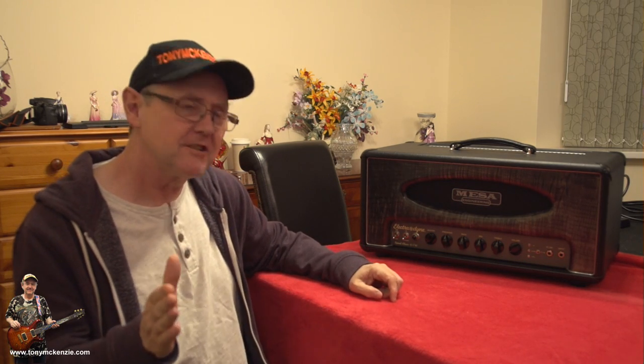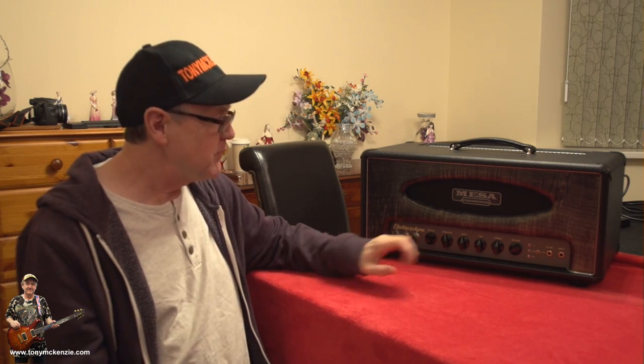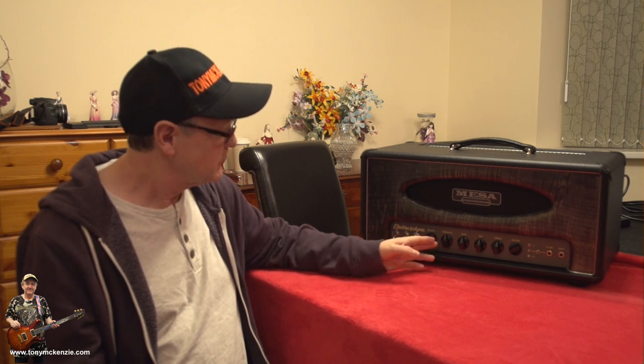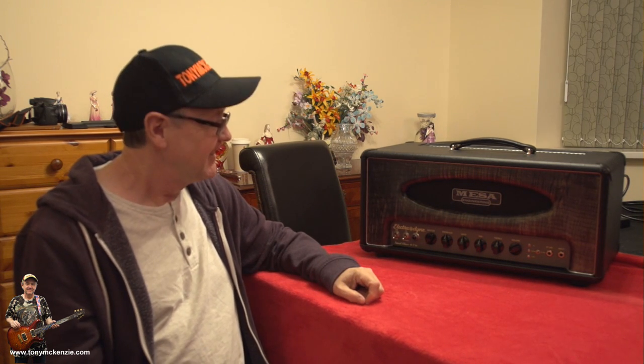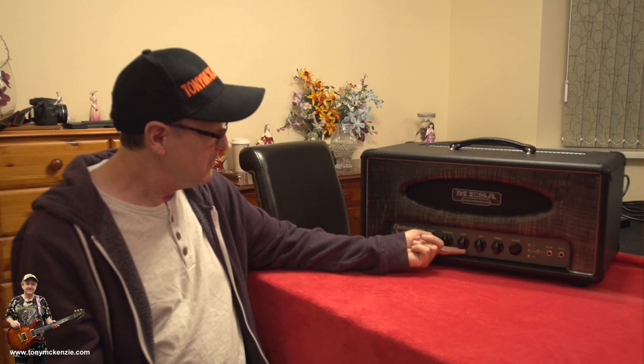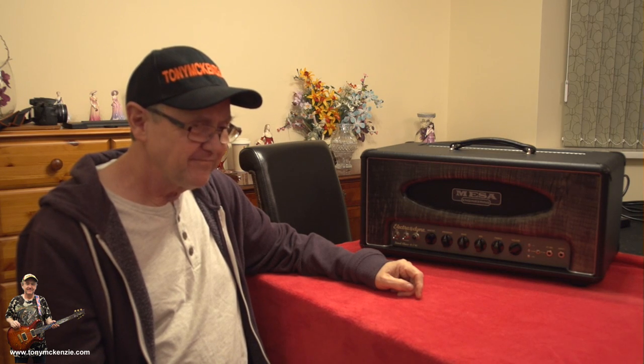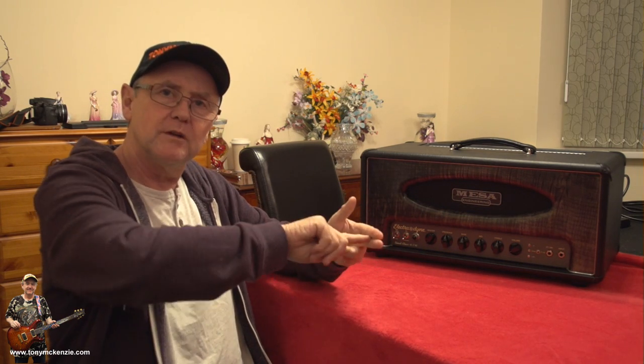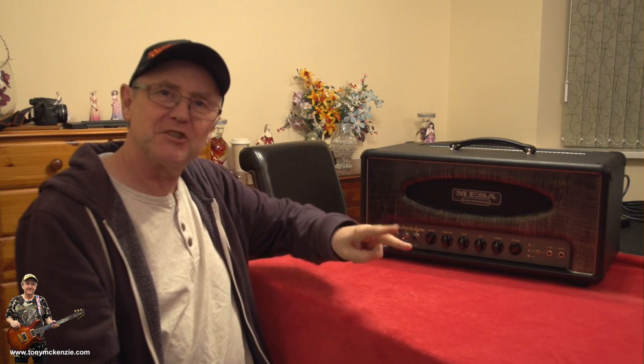So in effect, what you've really got is an amplifier with no pots on a channel, an amplifier with some pots on a channel, and an amplifier with, even though it looks like the same knob, some different pots. Well, that's a bit weird. Of course, the problem is, imagine having a potentiometer, you know, turns around like so, and you've got another one behind it. Well, when you turn the shaft that goes through them both, they both do exactly the same thing, don't they?